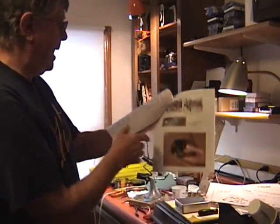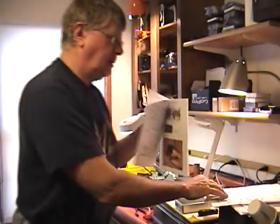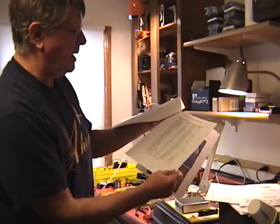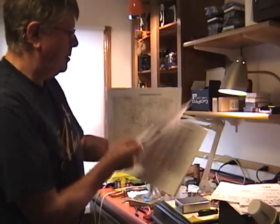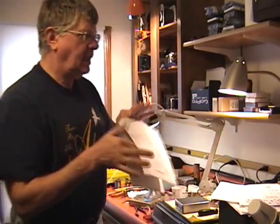I took the schematic from the kit documentation and blew up the VFO portion. As you assemble, check everything off and double-check that you've got parts in the right place. Check all your parts against the parts list — I had some discrepancies there. There are board and parts layouts here. Copy the schematic and use it to check off as you go. Those are my tips.